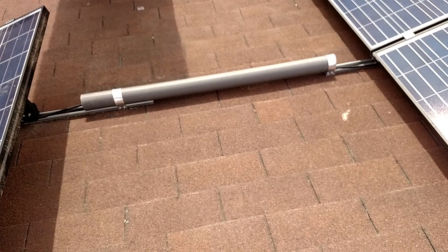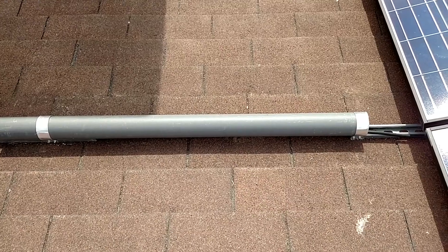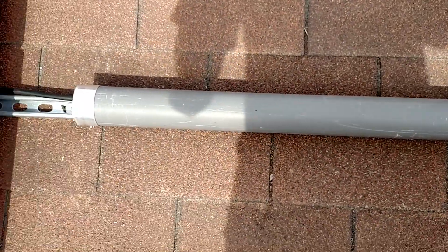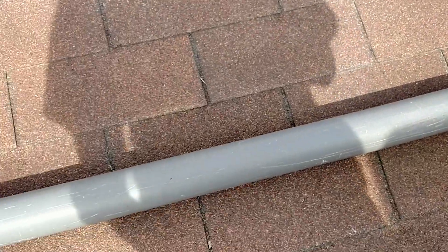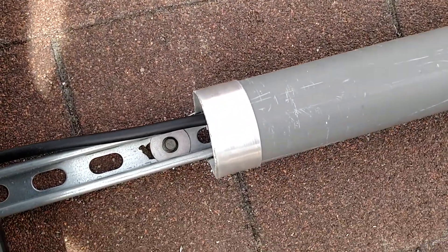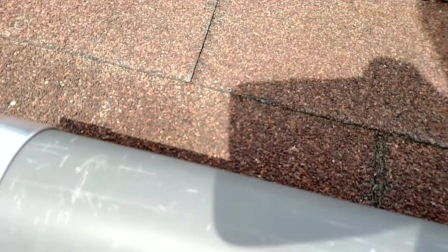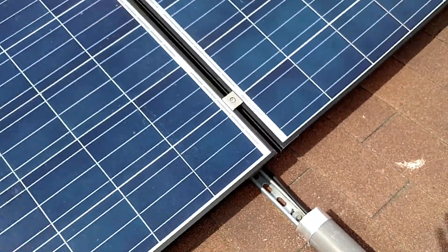I had another one here, and basically the inspector didn't like it there and said I had to protect it. So what I did is I ran it through a two-and-a-half inch conduit. I made these aluminum straps out of a piece of angle aluminum — bent it straight, cut two pieces out, basically strapped it down and tied it to my unistrut there with these self-drilling screws. Anyway, that's the whole array.